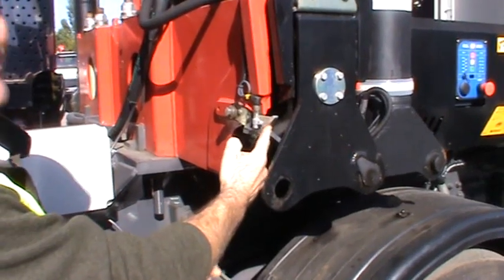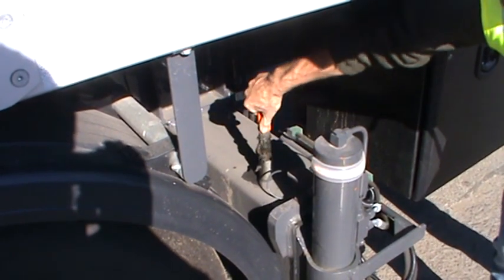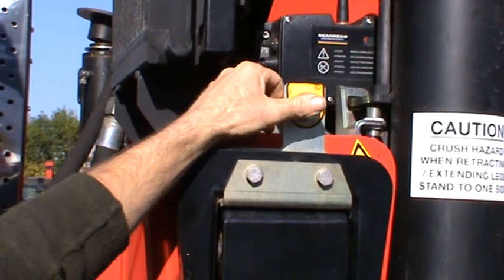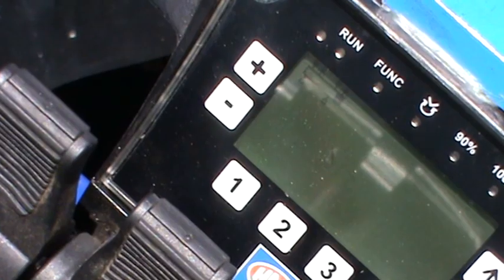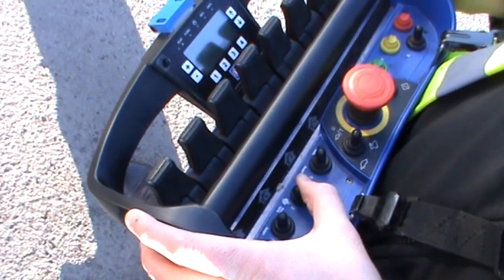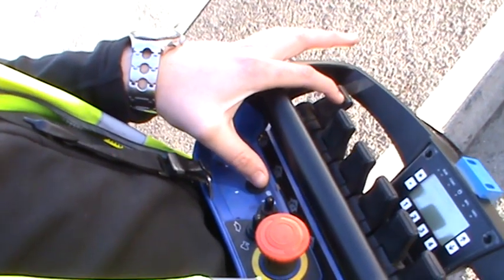We are going to start at the near side. Lift the near side front leg beam lock and sit the latch on the plate. On the near side rear leg, lift up the leg beam lock lever. One of the safety features is to tell the crane which side of the vehicle you are working from by pressing the ID button. Arrows on the chest pack display will illustrate that this has been successful.